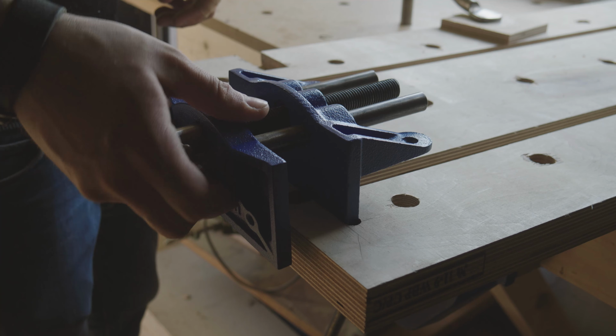But because simple screw clamps protrude and would then be in the way all the time, I want to put rails on the bottom side. For those there are specific clamps that fit into the rails so they don't interfere. The plates get a 90mm hole grid, like I'm used to from my workbench, so I can use clamping elements and bench dogs, which multiplies the possibilities of such a workbench.